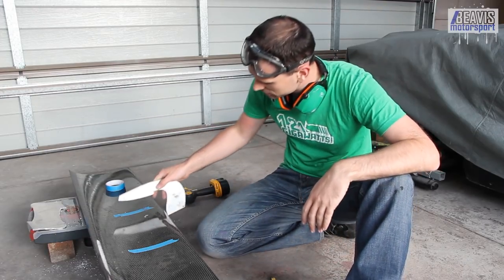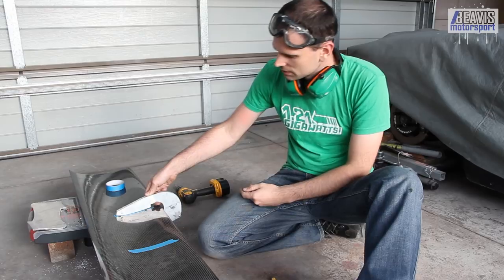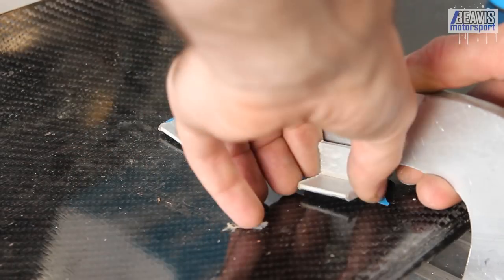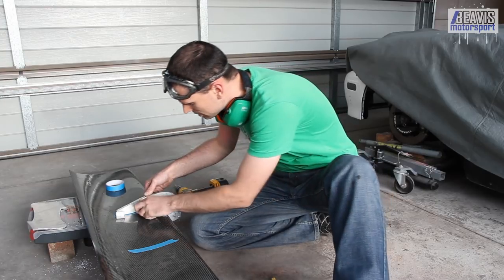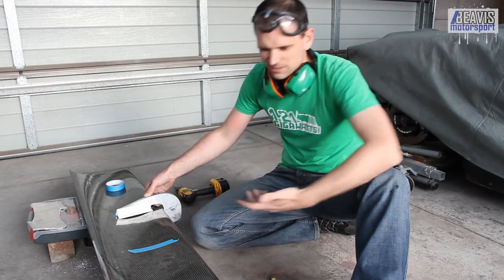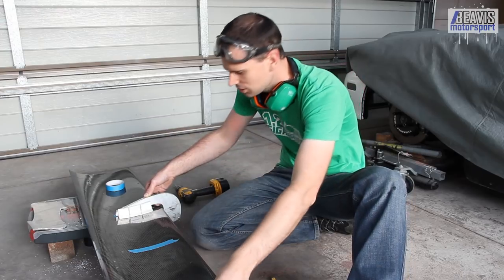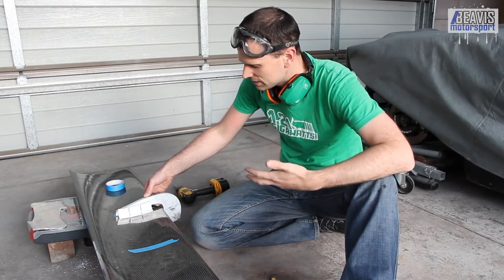To work out exactly how this bracket is going to attach to the wing — we need some sort of 90 degree angle to attach the mount to the wing. The first thought was a couple of little angles, really easy to do, super simple, but perhaps not so elegant. Then I thought maybe I can make one single piece, a bit longer, give it some shape — but that leaves a big gap underneath, so not really ideal. So then I thought, why can't I bend it? I don't have fancy benders, so I notched it with the grinder, just took two cuts out, and that was enough to give it a curve that pretty much sits flush with the wing — an acceptable level.